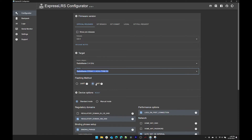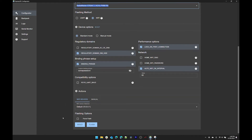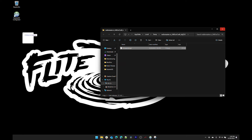Select Wi-Fi for the flashing method. Everything else should already be set from the radio setup, but to confirm: select the non-EU regulatory domain, and make sure your binding passphrase is the same as it was for the radio — everything else can be default. Click Build to create the firmware file. Once it's done, drag the firmware.bin file to your desktop so it's easy to find.